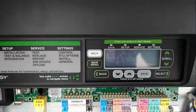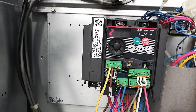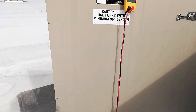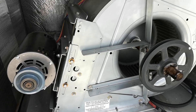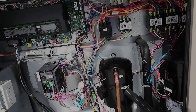It lives! I've got the system in testing with the blower on 50% — 50% is 29.3 Hz, and full speed would be 60 Hz, so 30 is half. That's correct. I've got the belt off just so I can watch it; I didn't want it to kick on and explode. But it's running — looks like we just had a bad VFD.